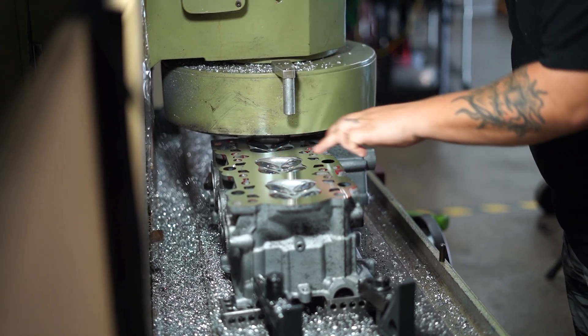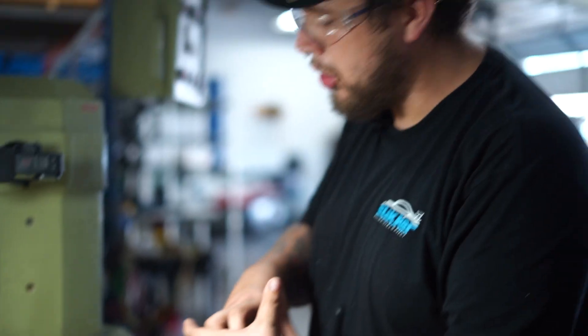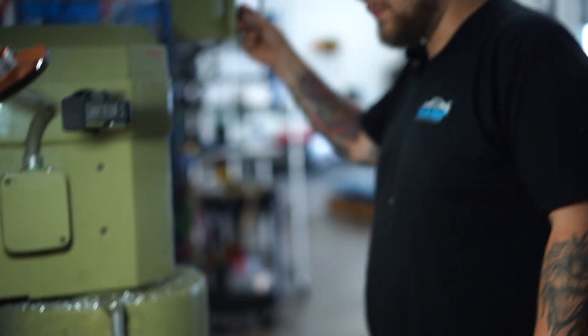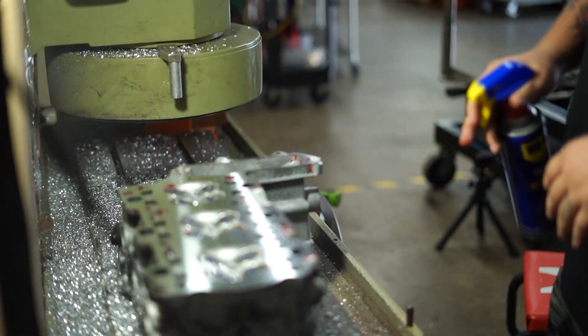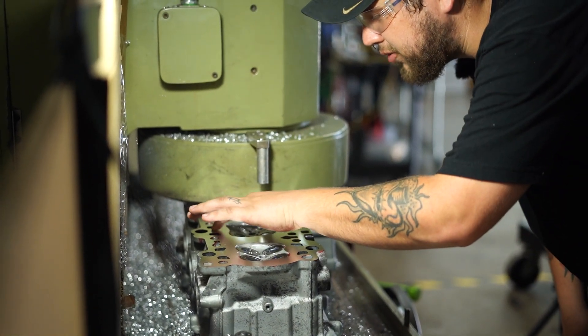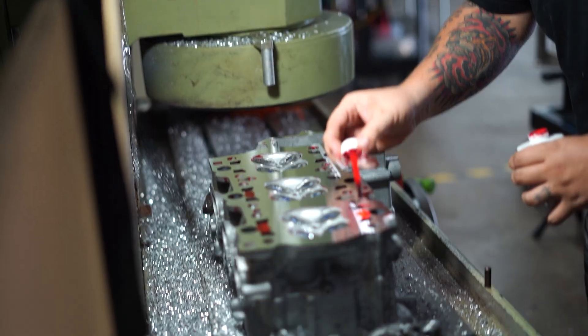My favorite part of this process is watching the deviations in the head slowly work themselves out until you get that nice, perfect mirror-like finish. It's kind of like watching a loading bar — you get anticipation and all of a sudden you're there and it looks awesome. I'm going to apply a little bit more Dykem to just the areas we're concerned about. Most of this right here has no more red in it, so the surface is flat and clean. But that color deviation in the finish is actually the penetration of that corrosion into the material. In this spot right here, you can still see a little bit of red — that means it's still that raw surface from before we even started. We're at eight thou now, just doing between one and one and a half thou passes, slowly but surely. It's really important we don't take off more than we need to — I could do three or four thou passes at a time, but then I might take off three thou extra, and the normal amount we take off is two to three. That would be a whole other rebuild taken away from these heads.